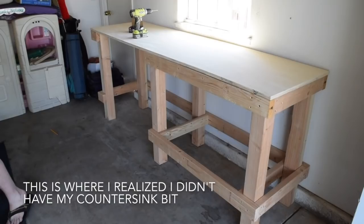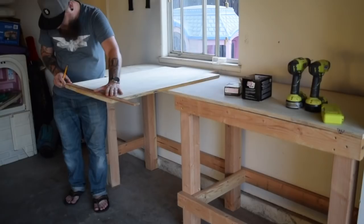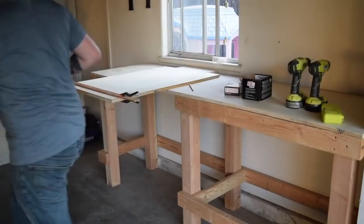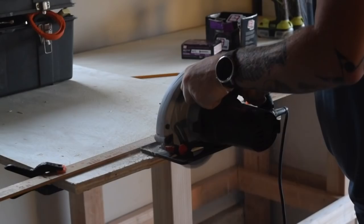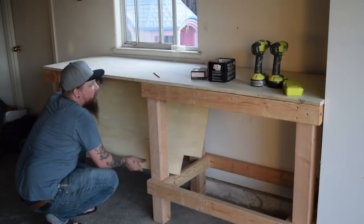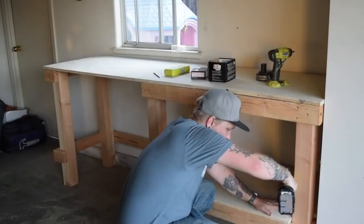I hadn't put the shelf in before taking it to my parents, so it was about a 1/2 inch too long. I had to trim it down with my stepdad's dull beyond explanation circular saw. Fortunately, my mom had a yardstick laying around, and my brother had some just strong enough clamps to make a straight edge to cut along. After fitting the shelf into place, all that's left to do is drill, countersink, and drive screws in.